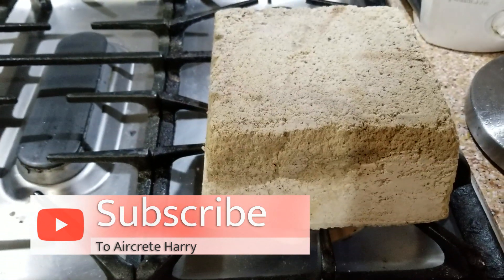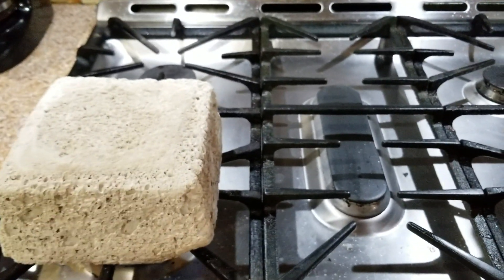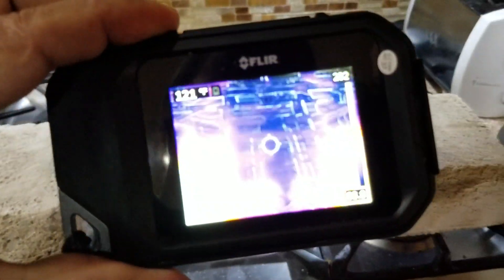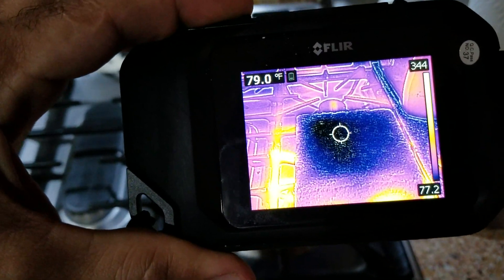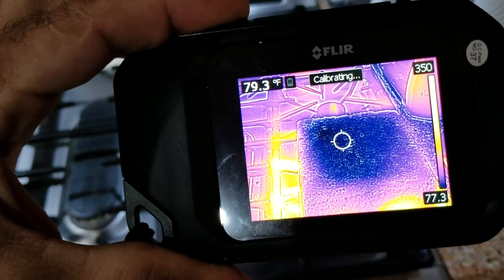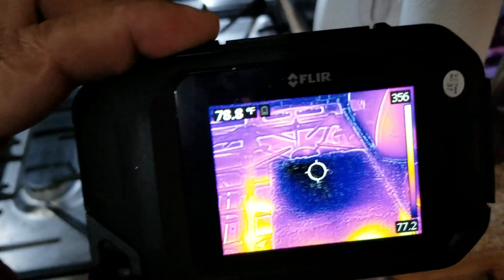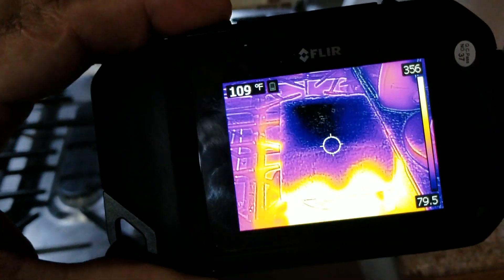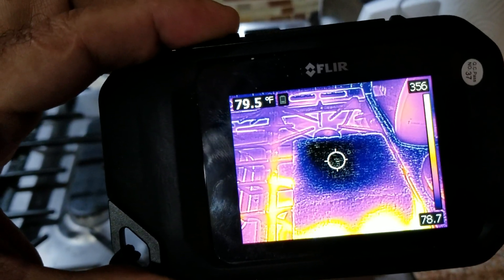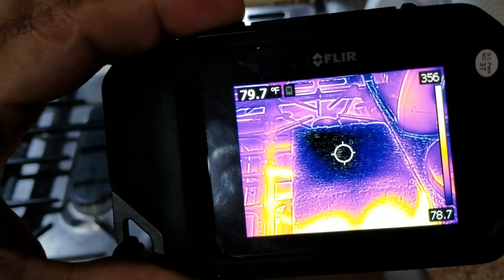Right now the 30-gallon mix is performing better. I didn't make a 60-gallon batch, but based on what I'm seeing I don't think I would use a 100-gallon mix. I might do this experiment one more time with a new batch of aircrete, but based on this I think a 50 or 60-gallon mix would be enough. When I say that, I mean one 94-pound bag of cement and six gallons of water in a 60-gallon container — about seven gallons of cement slurry — and you'd fill that 60-gallon container to the top with foam.